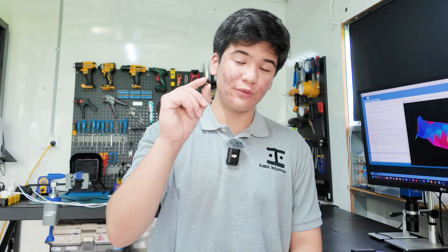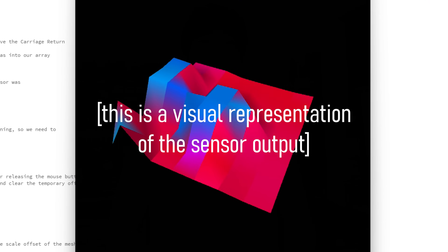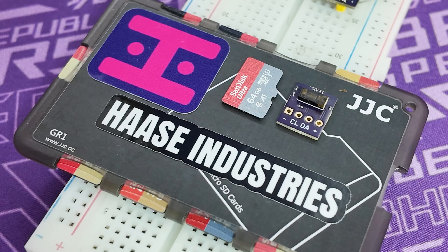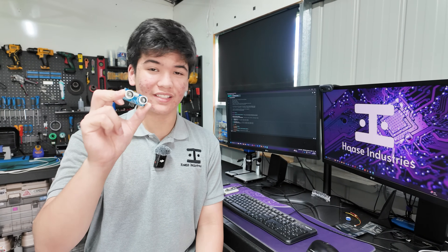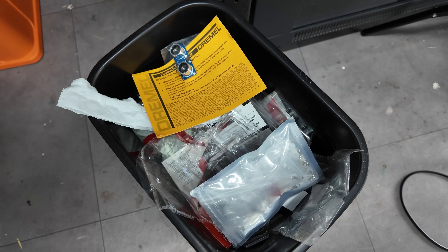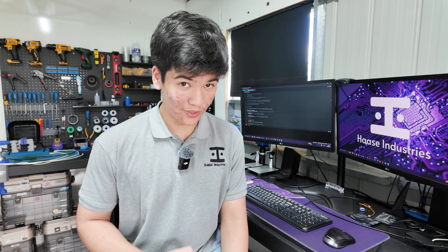Today I want to show you guys this cool new PCB I made for this sensor, which is called a multi-zone time-of-flight sensor. Here's what it looks like next to a micro SD card, which is only 11 by 15 millimeters. It's pretty much just like an ultrasonic sensor if it used infrared light instead, except it's way smaller and allows you to gather up to 64 pixels of distance instead of just one within your field of view, with a much longer range of up to 3.5 meters and millimeter-level precision.